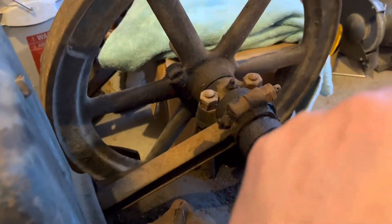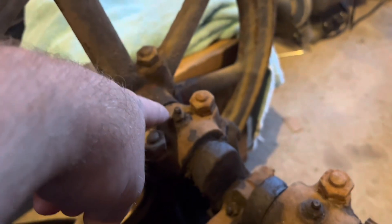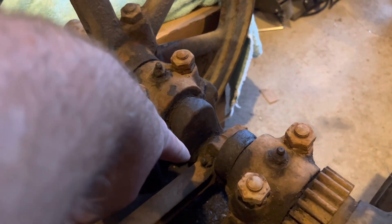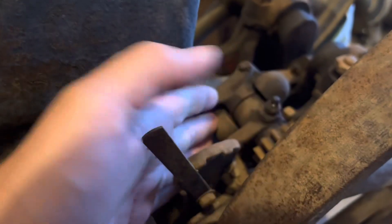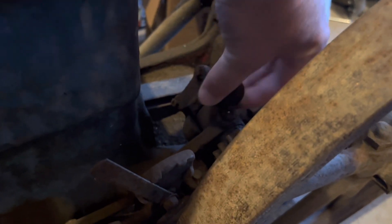First off, the engine turns over with no issues — it's not locked up or anything. There's some kind of problem with what I'm going to call the latch-out, because the valves aren't turning. Over on the crankshaft there should be grease cups, but somebody installed grease zerks — apparently that was a farmer fix. Same thing down here on the connecting rod, and there's one up on the governor shaft also. The weights on the governor are spring-loaded and still pop, which is a good sign.